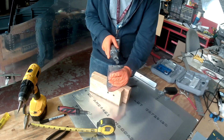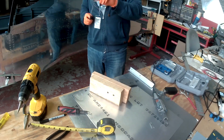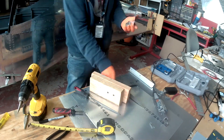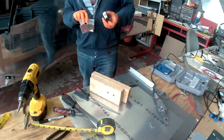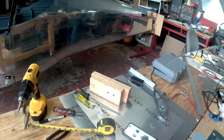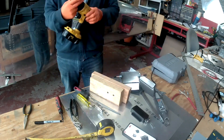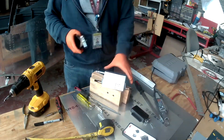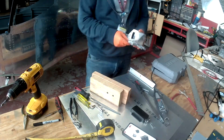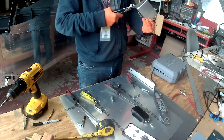The GMU 11 can be oriented in many directions. It's a long skinny little black box, and you have to treat the midline of that as pointing forward, or at least pointing in a cardinal direction. I'm basically going to have it sitting flat facing backwards, which is perfectly fine — but it still needs to be lined up to your direction of travel along that axis. So while this bracket is technically as square as I could get it, once it's mounted onto the wingtip and we turn the system on and start doing orientation checks, it might be a few degrees off. It needs to be within plus or minus three degrees.